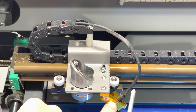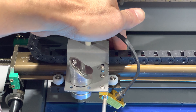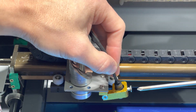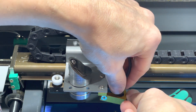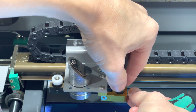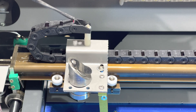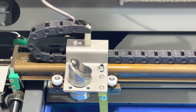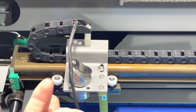The first step is to loosen the little red dot pointer and unscrew it so it just pulls straight out, getting it out of the way. We'll be unscrewing the drag chain from the top of this laser module, then lay it flat so we can thread the air assist tubing through the drag chain more easily.